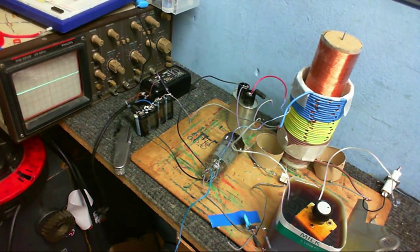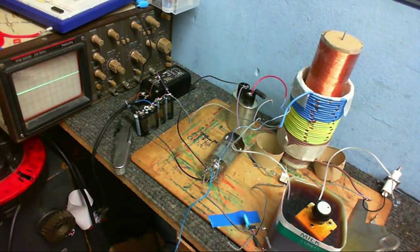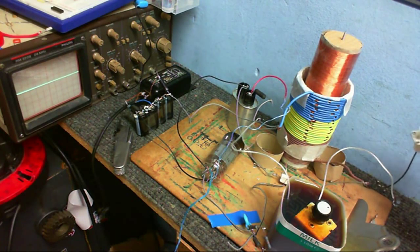So now I'm going to try it with the other coil again. I was talking to one of my fellow YouTubers, Electro, and he said that a 1 nanofarad capacitor — which is what I was using with this coil — is way too high. He said I need something more like 450 picofarads. So what I've gone and done is I've taken the input filter capacitor out of a magnetron from a microwave, and I measured it — it's about 650 picofarads.